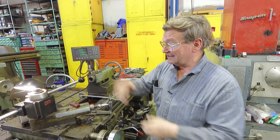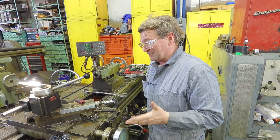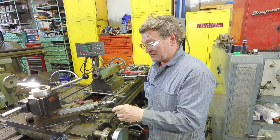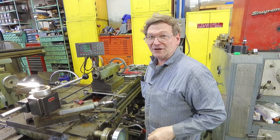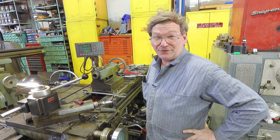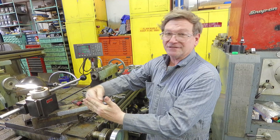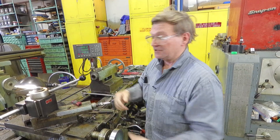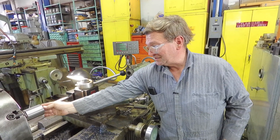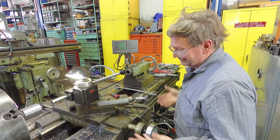This is designed so you leave a pretty good flat on the top. The spec on this — I'm not exactly sure what this thread is, it's not fully matching anything in the specs I've got for drill threads, but it's close to one of them. That one lists a sixteenth of an inch flat to forty thousandths of an inch flat depending on where we're looking in the charts. The male piece is measuring about seventy thousandths flat on top. You fit them so the V fits up but leave the extra flat so they can move a little to find their location, and you want the thread to start getting tight at the same time it comes up to the shoulder.